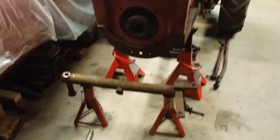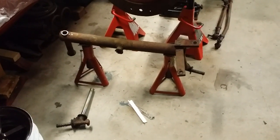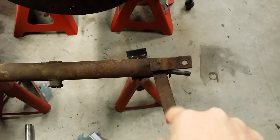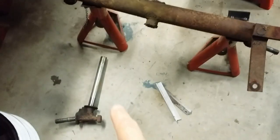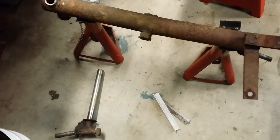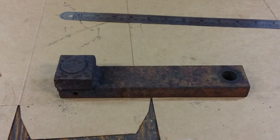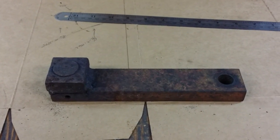Today I am continuing efforts on the front end of my senior. What we're going to do is the knuckle that was on the top - it looks like this roughly - we're going to drill out the one inch piece of bar stock that's fuse welded into the top of it. Here it is up on the workbench. This is one of the steering knuckles for the senior; looking at the front of the tractor, this is the left side.